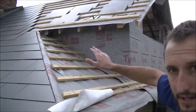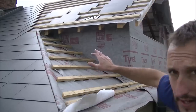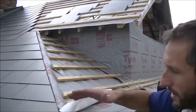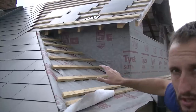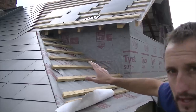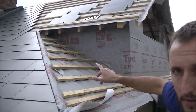I'm going to attach a piece of lead to a batten before I continue slating. The reason for that is, on the top of the hip, when I put on my final ridge tile, I'm going to overlap the lead over the top. I hadn't put that in place - it was something I thought about a little bit too late. For the sake of a few minutes' work, let's do it properly.